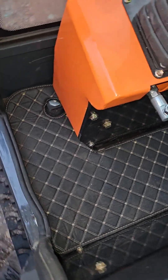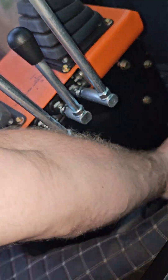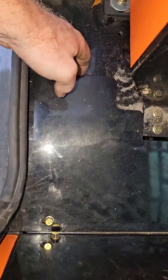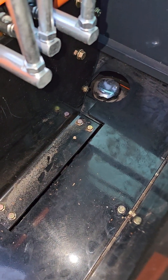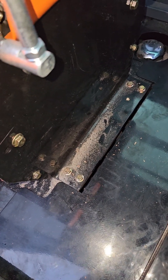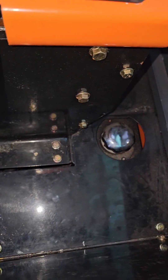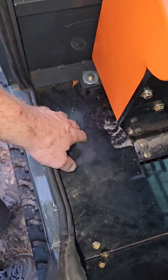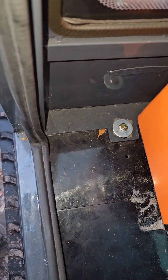Under this little mat — I hope you never have to service this, because this is clearly an afterthought. This is the same model as the FF12 and this plate is almost impossible to get off. I took it off today trying to get under it to find a fuse or something — I don't see a fuse box on this thing; there's one random fuse, I'm assuming for the ignition. Once you pull it out, I'd cut it down just so it's easier to put back in. There's your hydraulic fill, and your battery is actually under here — it's a pretty good size battery. The cab bolts were loose this morning, so I would check them.